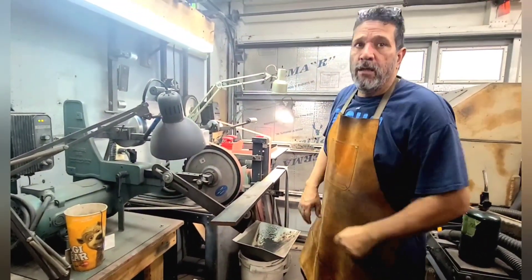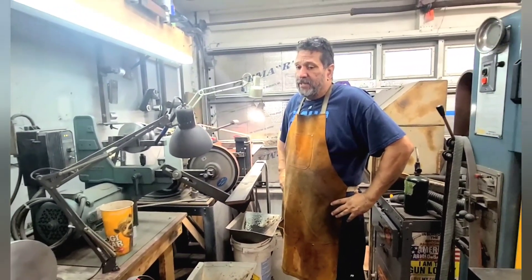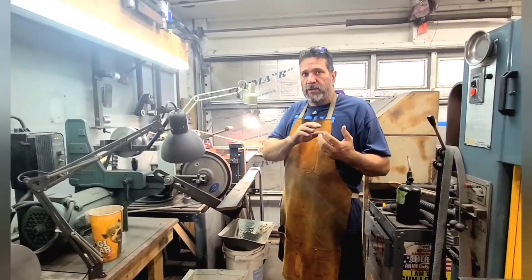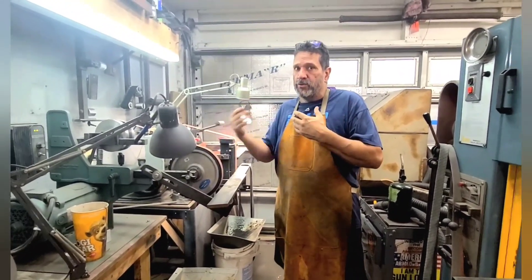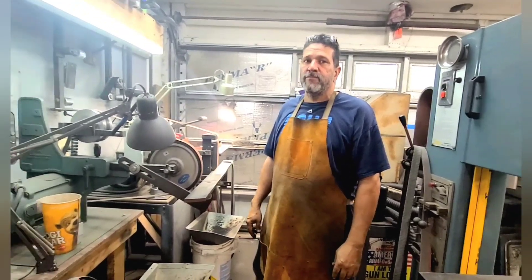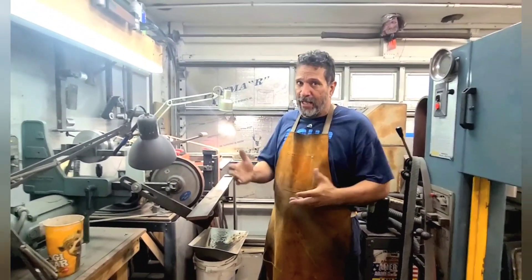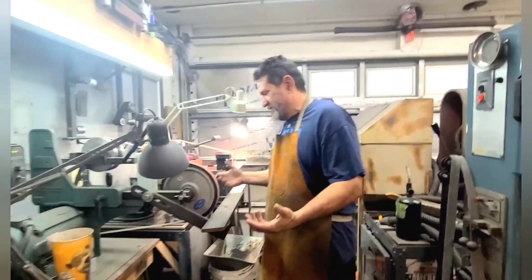Use the belts like they're free — someone said that, I heard. Because if you don't, you'll be wasting time burning stuff. Most of the time what you're doing is getting scratches from one grit to another. If that belt has a little bit of wear on one side and not so much on the other, then you're creating deeper scratches on one side that you don't see — then you got to deal with that later. When you pass to the other grit, basically you're passing those scratches. Then you either got to go back or take twice as long with the higher grit. And normally what I do is after I finish my blades, I sand them by hand. So anyway, if there's scratches, it's a catch-up. Very cool. A little bit more work, but it's the fun of hand making.